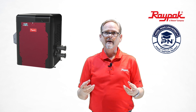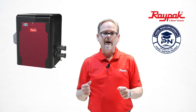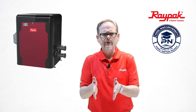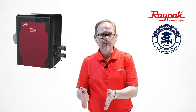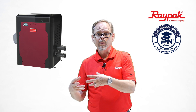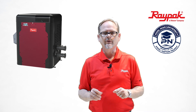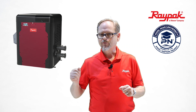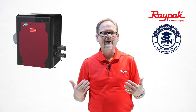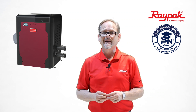The ProTec Shield is another device that's available on any residential size Raypak swimming pool heater. This is a built-in standard piece of equipment that helps to mitigate the effects of damage due to ionic migration within the swimming pool itself. Anytime you put two different metals in water, you create a battery — a small amount of DC voltage flowing back and forth between the two metals — and the less noble of the two metals will deteriorate at a faster rate. This is called the sacrificial anode. What if we put an anode in from the factory that is even lower on the nobility scale than what you might commonly find in a swimming pool? This is what we've done with the ProTec Shield, which comes standard on both the Avia and the Digital.